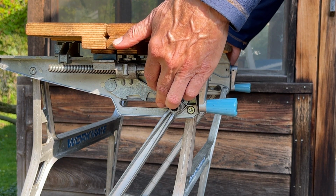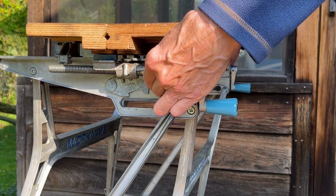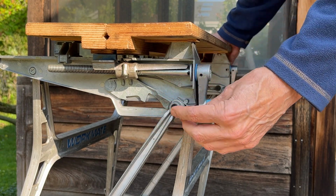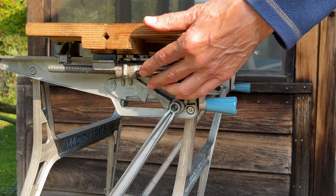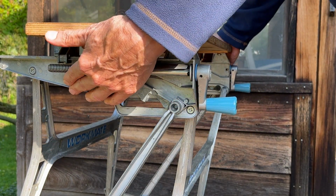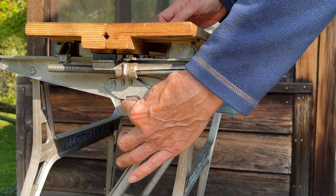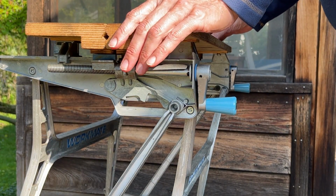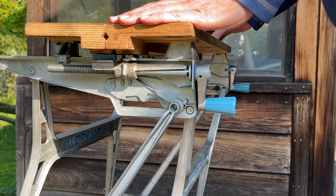When the Workmate is in the open position, the front end of the latch drops down like this. It traps the upper end of the side strut against a stop on the frame. When the Workmate is folded, the rear end of the latch traps the end of the side strut at the other end of the slot. This is different from later 7901s, which use 2 separate latches for the folded and unfolded positions.